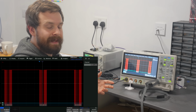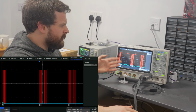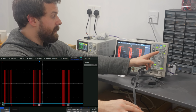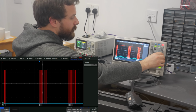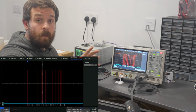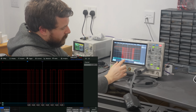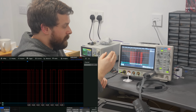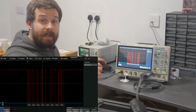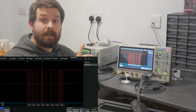So what happens if we press the up button and then capture the information that is being sent? If we press the up button on the desk, it doesn't really look like much happens on the surface. But if we press and hold the up button and then capture the data, and then we zoom in on the actual data being produced, you'll see that the payload, or the serial data that's being decoded, is ever so slightly different than that heartbeat signal. So this bit in the middle is the most significant change. So we have the 9B0602, same as the heartbeat, but then it changes and we get 0100, which we can see is different to the heartbeat signal. And this is most likely the payload for triggering the desk to go up.